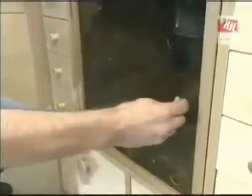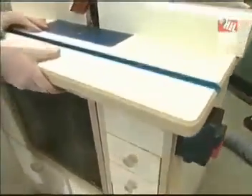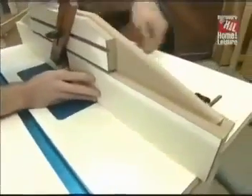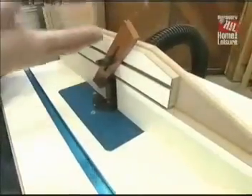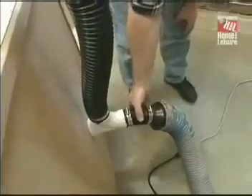Here's a big improvement: this plexi panel is now hinged rather than trying to get it into a slot, and I've changed the dust collection system so it'll be more efficient. Found a switch that's a lot less expensive, made the top out of laminated MDF and high-pressure laminate — things easily available at any home center. We've also improved the hardware for fence adjustments so it slides more easily, and made the fence out of MDF so there'll be no twisting or warping. Dust collection comes right off the fence, joins up with the compartment below, and goes out through either our chip collection system or a shop vac.